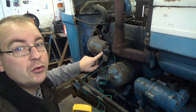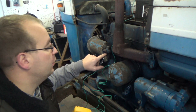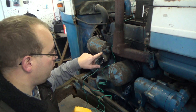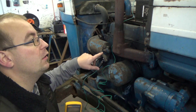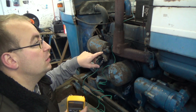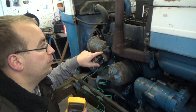There's one pin to excite the windings inside the generator, and there's one bigger pin where the power is coming off the generator. Normally this pin is regulated by the voltage regulator on the tractor, but it's not functional right now. I've gotten off all the cables and found the place where it went wrong.